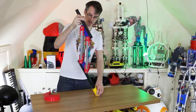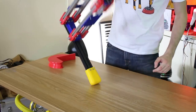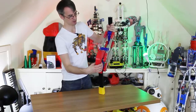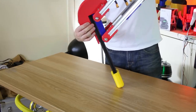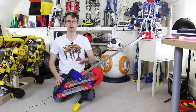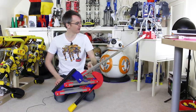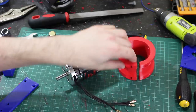There's my main leg assembly which looks pretty rigid and I've got one of Open Dog's spare feet on there just so I'm not smashing my table with a piece of aluminium. I've got bearings in the top and bottom, eight mil studding, and everything's done up with T-nuts onto the 2020 extrusion. Now I need to put this piece on the back which makes a pulley that pulls around the knee. There's a motor higher up on the back that's going to pull that tendon to hopefully make it jump. I've got a pivot that holds the top of the leg so it doesn't fall over sideways during testing.